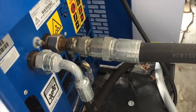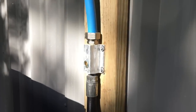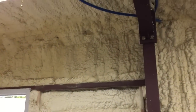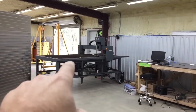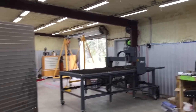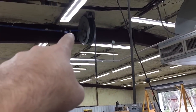Back in here, you can see that the back of the dryer is where your air comes out. I had this hose made up at a hydraulic hose place and it's a 3/4 inch ID coming up to a junction block here, and then we convert over to the Rapid Air blue lines. Those go inside the shop — you can see the blue lines coming in. We've got one going to a motor guard filter and to a hose reel, and then the other line coming off of that compressor routes over this way and comes over to the plasma table. We're feeding one hose reel and the plasma cutter, and then another hose reel off of the one compressor. And then the traditional upright tank piston compressor — we've got a separate line coming in for that, and on this one we just go to the hose reel.